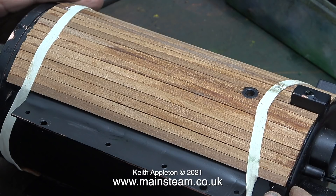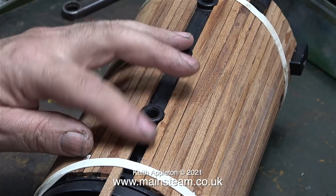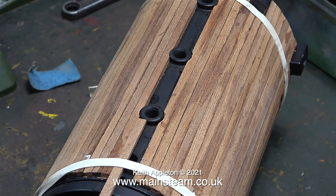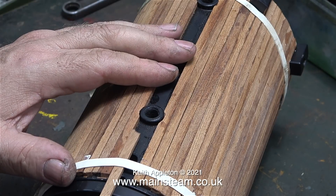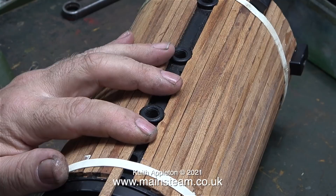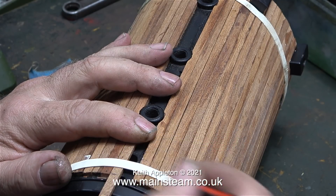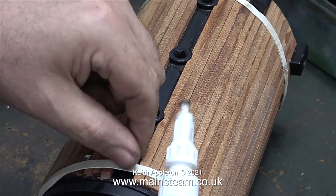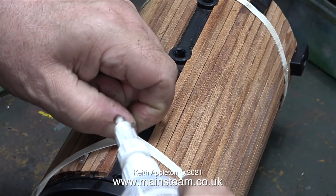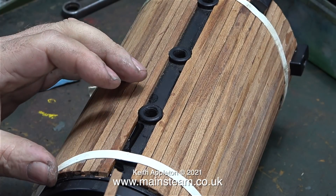Fitting of the rest of the mahogany strips was exactly as I showed in the last video, and here is the boiler with them all in place, apart from the fiddly bits at the top that are all covered by a long metal strip. The procedure is simple: first I shape the end of a piece of mahogany strip, check that the part fits perfectly around the bush, mark it with a pencil, cut it off on the bandsaw, and then using superglue or cyanoacrylate adhesive I stick it in place. You will notice that this cladding has been applied over the top of two holes which form the inlet and outlet to the coil superheater in the smoke box.